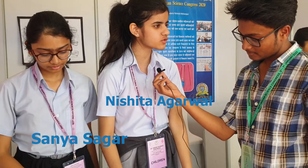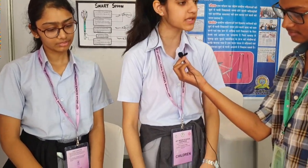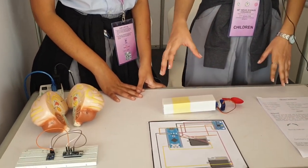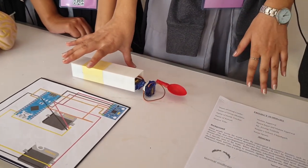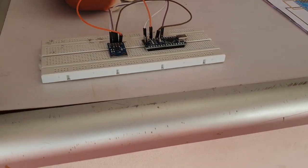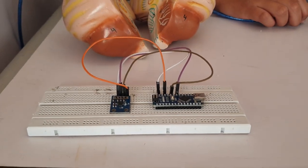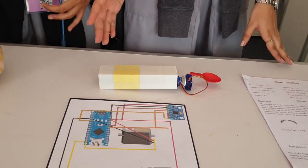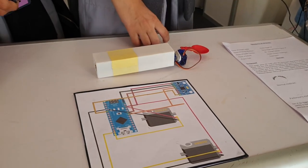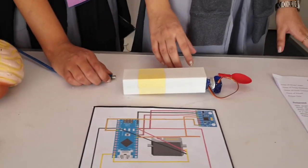This model is based on a disease known as Parkinson's disease. The person who suffers with this disease experiences tremors. We have made this model inside the handle of a smart spoon. We have installed some sensors and microcontrollers. The sensors collect information about in which direction your hand is moving, and then these two servo motors rotate in the opposite direction of the movement of the hand, and hence they cancel out the tremor and the bowl of the spoon remains stable.